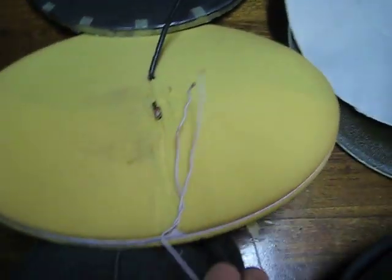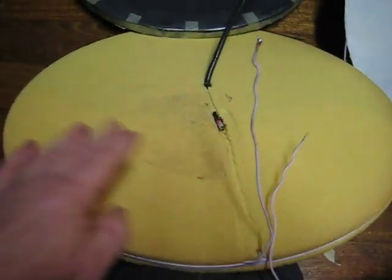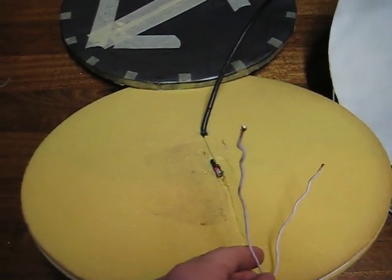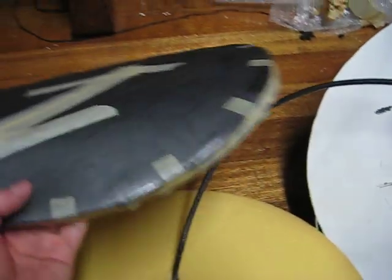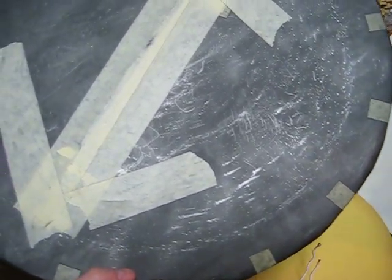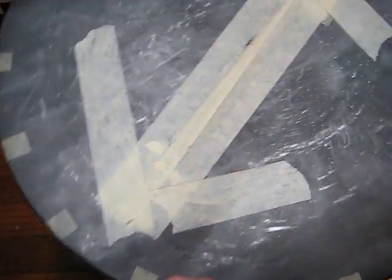Anyway, this coil's got a heap of good wire in it which I'll use to build up a new coil. I'll probably use part of the foam structure here as a strengthener in the coil assembly, and I'll make up a properly shielded coil — using a proper shield rather than this graphite sandwich construction. That adds a lot of capacitance between the actual coil assembly and the ground. I reckon using this stuff probably upsets the ground balancing, but I'll soon find out when I wind it.